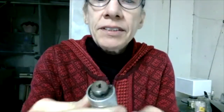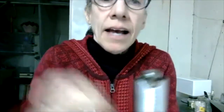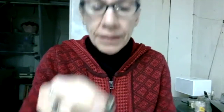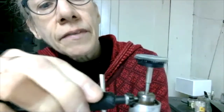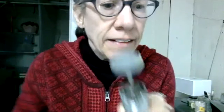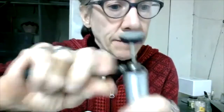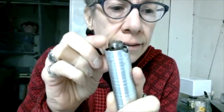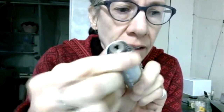So you can open this and you will see on the handpiece, there is a divot here and there are three little holes. And then there's a bunch of teeth, right? So you put your bit into the handpiece, making sure that it's straight up and down. And then you insert this right here and you tighten it like that. Or you loosen it, as the case may be. One thing about the teeth here is that they get worn down. Maybe that's why you have three options to stick the collet key in, because they get worn down. And when all three sides are worn down, you'll probably need to get a new handpiece. They're not that expensive, but just keep that in mind.